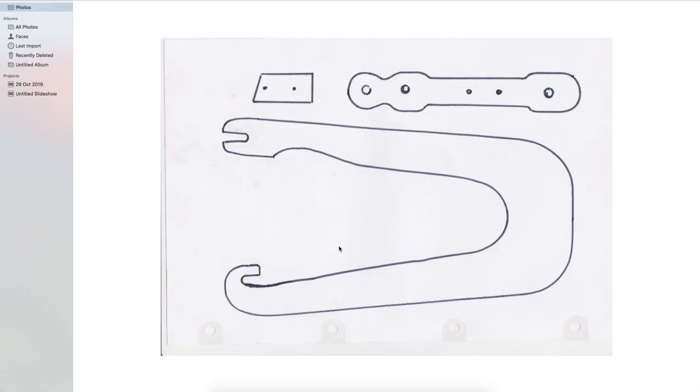So that's pretty straightforward. You can get a broom handle or a wooden handle, and if you're cutting this from 3/8 or 1/4, then cut a slot 3/8 or 1/4 down the end of the handle, and then put it on here, and with it on, drill 2 holes here that you can attach this to your handle. I think that's pretty straightforward.